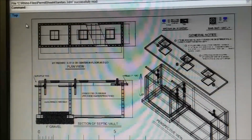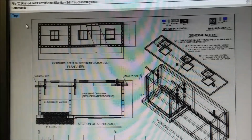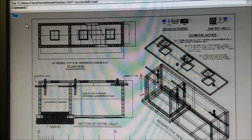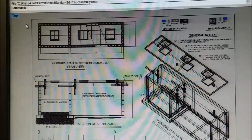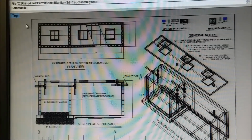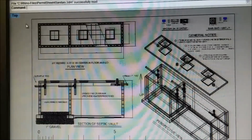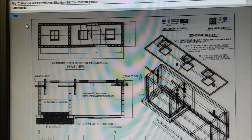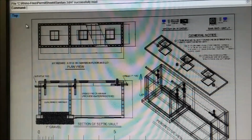Now you can come up out of the top or the sidewall of a septic tank for a vent, as long as it's above the water level, and go over and run it up through something, a column in the house or whatever, or just straight up if you have something to hook it to, and get it up above the roof, and it'll thermal siphon. The heat on the side of the pipe will make the air lighter. It'll go up. It'll draw air in from, in this case, the one on the left.